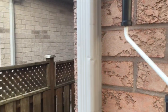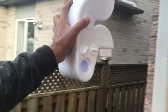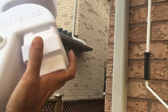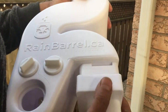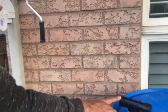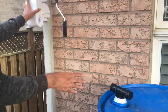We will use the square adapter to connect to this pipe. The adapter goes at the bottom of the diverter, oriented towards the wall. It has a locking mechanism which locks it in place — if you want to remove it you just push it hard and it comes out. From here it will connect to the rain barrel. You have to measure it correctly and install it at the right height, otherwise the water will not flow properly.